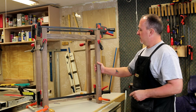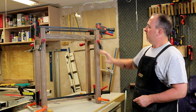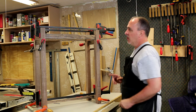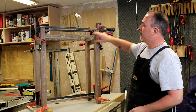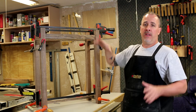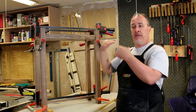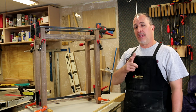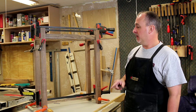What we've done — as you can see, it's solid walnut, a very simple square structure. We used dowels for all the joinery. What's left to do is cut the notches in the top here. I'm going to have some cross braces that come across, which are going to give the cabinet a floating effect — basically it looks like it's going to be floating a little bit above the stand. Let me get the camera and give you a closer detail of what we've done.